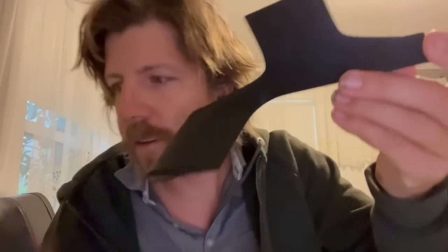This is the carbon fiber PLA and it's just so smooth — really cool material. The layer lines almost disappear. You can kind of see them when it's really broad areas, but when they're going up and down it's just like a really matte look. It's supposed to be a little bit more brittle, but it's definitely more stiff.